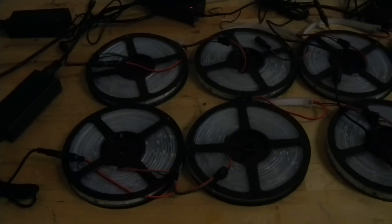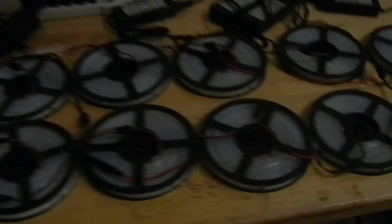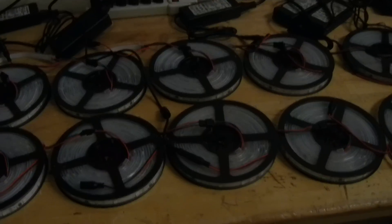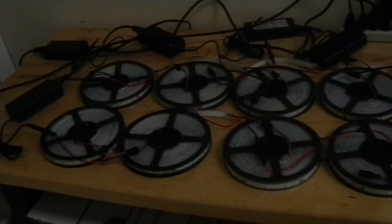I went all the way to the very end, skipping lights and adding power supplies to make sure we have enough power. We also put a six-amp power supply at the very end of each side. On this system we have a total of 11 six-amp power supplies, which is 66 amps total for a complete 20-roll system. You can get a 66-amp, 80-amp, or 100-amp power supply to run every single one of these, as long as you have the right connections — your electrician would know how to set that up.